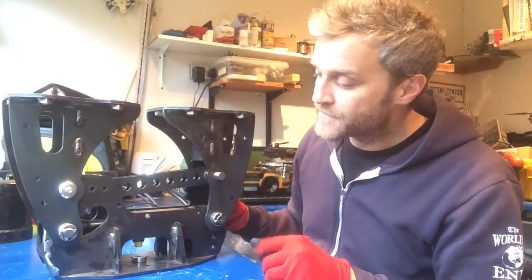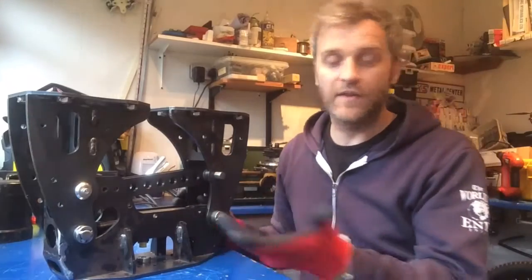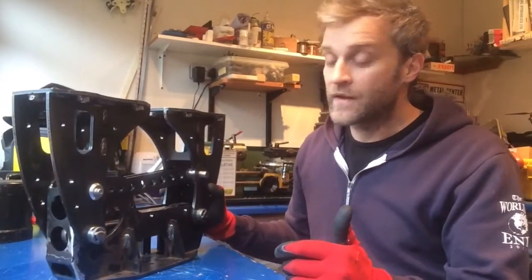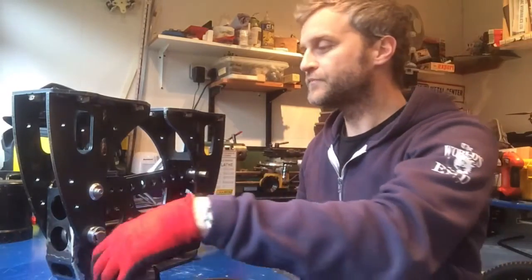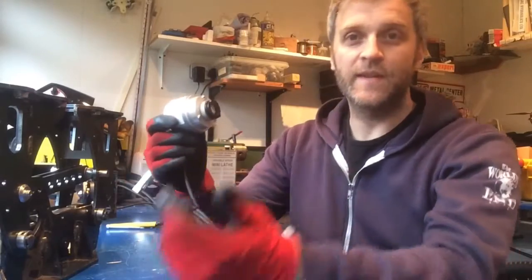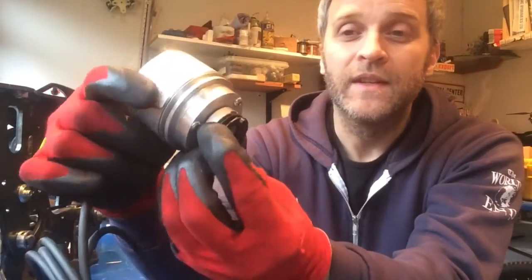What I'm looking at now is adding feedback onto the joints, because all the axes of the pan and tilt head and the gripper are going to be closed-loop control. That means I can control the position of all of them via the computer, same as all the other axes on the Mantis. I'm going to be using absolute rotary encoders to close the loop and read position back. These are 15-bit, so that's 32,768 positions per revolution - really high resolution. I had some left over because the Mantis originally had four axes per leg and we went down to three, so I had six of these spare.